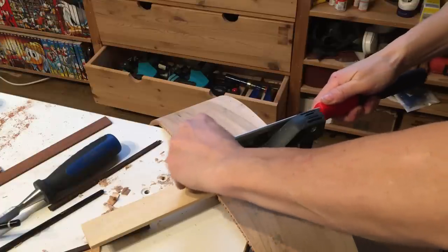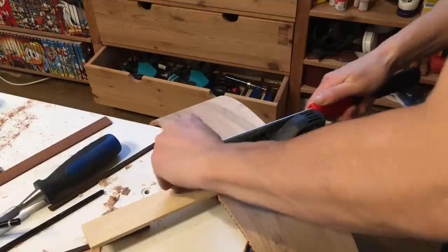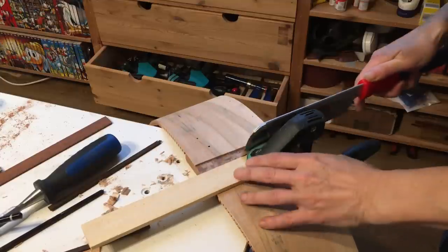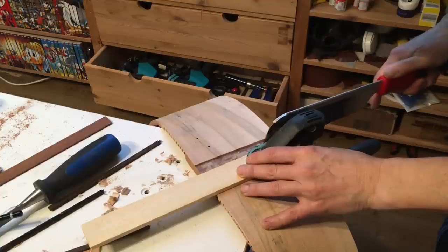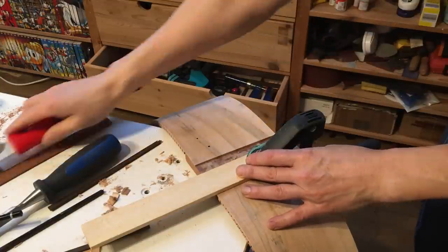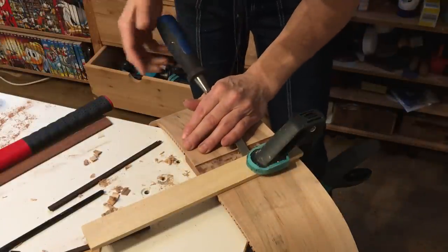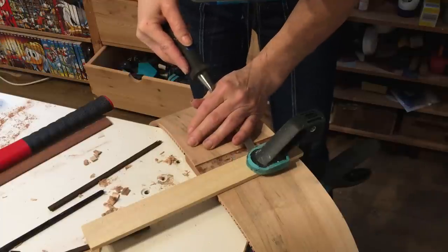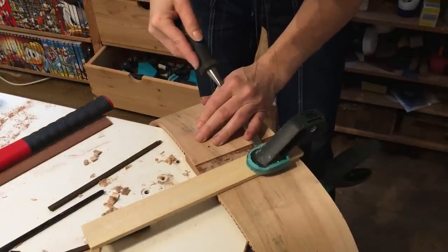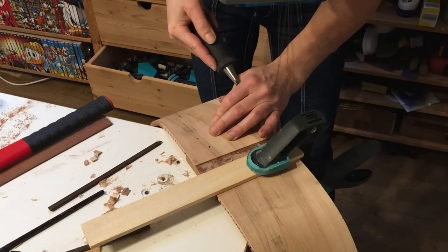I wasn't entirely clever with this because I cut my channel the wrong way around, so that the V would open up to the bottom and not to the top as is usual. So what I decided on is to make a parallel cut, so not a V-shaped cut, but just a straight strip covering where the sides join.